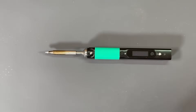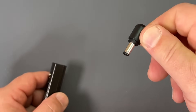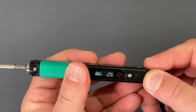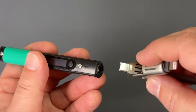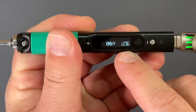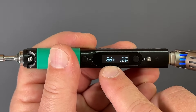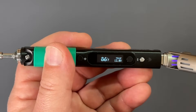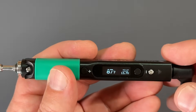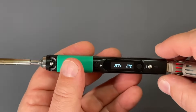So let's plug this in and I will show you the screen and the displays, and then we'll solder some stuff and see how well it does. Here is a coaxial plug — this is actually the one for my ICOM 705. But what I care more about is USB. Here's USB-C — plug it in. You can see we have the voltage, we can see the temperature: 704 degrees that I have the iron set at, and we have the current temperature of the soldering iron because I haven't actually turned it on yet. But notice when I plug in the DC socket, we're showing a higher voltage, so this will actually perform a little bit better with a higher voltage, but I've not had any problems whatsoever with USB-C PD. So that's what we're going to use.